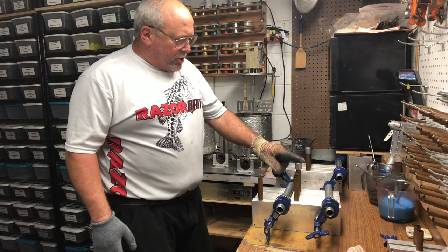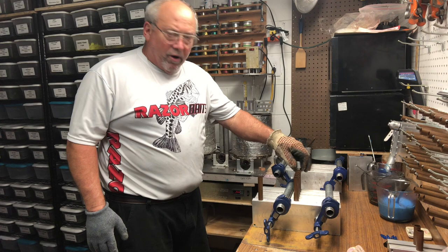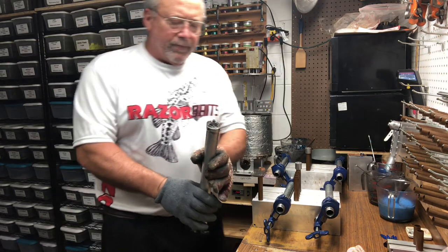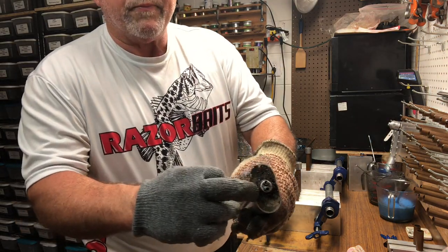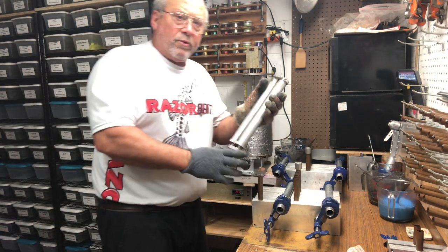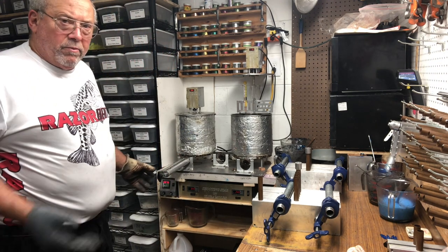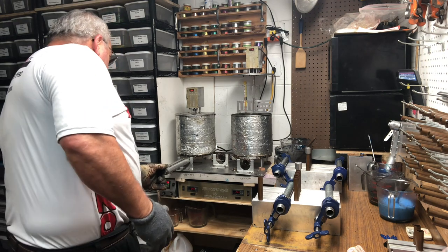Like I said earlier, I have this one sprue extender cap that I had bought from Bear while he was still in business, and I put it on top because if you look at the injector nozzle, it's hard to see because of all the crud on here, but there's an O-ring right there. And that O-ring will get damaged if you put it down on top of that thin copper edge. So I put the injector in the bracket into the orifice or the port.